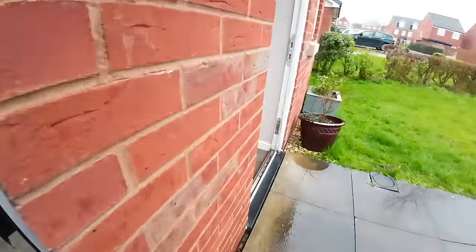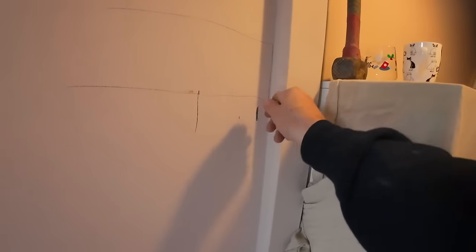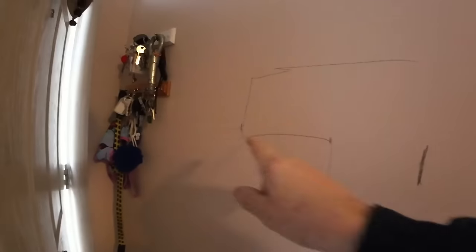Where's the gap of this? And then we're going right into this corner. We ignore this. This is our new mark. The broad marks are our new marks. And then it's going to give us 730 here, which will give us 600 radiator to go back on the wall there. Obviously it's going to have to fettle with the pipes. Just take them over, take the plaster off and go over a bit, but that's our plan.